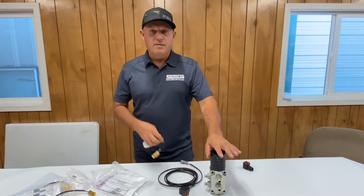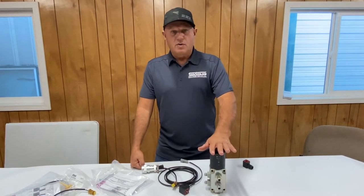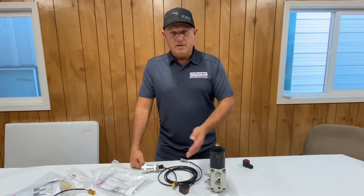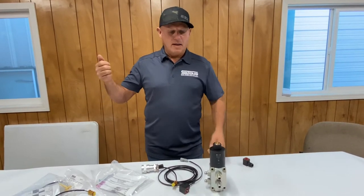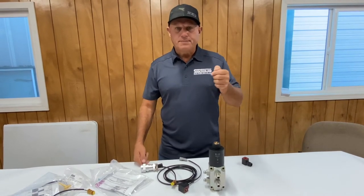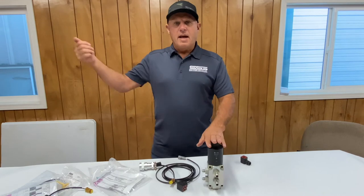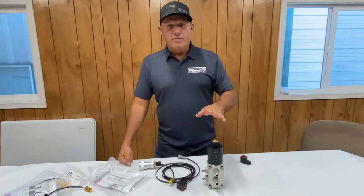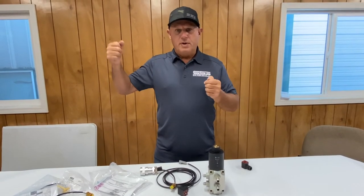To operate this valve, you'll touch the button and it triggers the solenoid, taking it from the primary feed to the secondary feed. On the cement mixer, your primary feed will be your paddles — you use the pump control on your right stick to go forward or reverse. When you want to open the chute, push whichever button you've identified and use that same paddle control, because the button just selects the valve from primary to secondary, and then the pump control makes it go forward or reverse to open or close the chute.